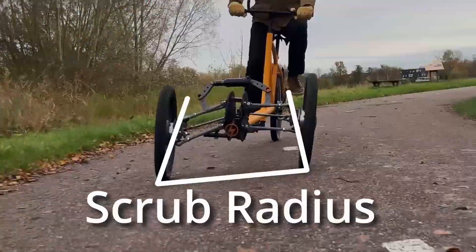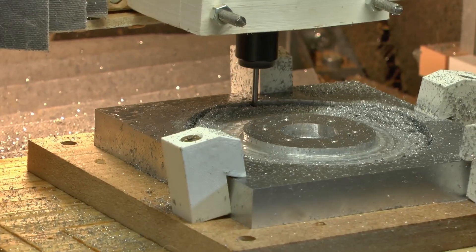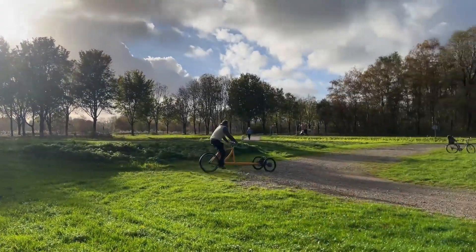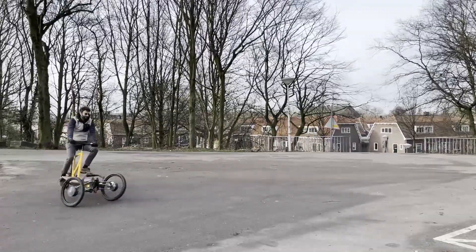Many lessons learned, and many more to learn. I made a trike with adjustable geometries to find the best ride. The fabrication techniques improved — using more jigs and my self-made notching machine. I even attempted to make the hubs in aluminium with my CNC machine, but failed to turn the part around exactly, so I ended up ordering the part from a CNC shop. After everything is put together there is always a sense of accomplishment, then it's time for a test ride and testing all the geometry adjustments. After many adjustments and tests, we arrived at a geometry that is great to ride.